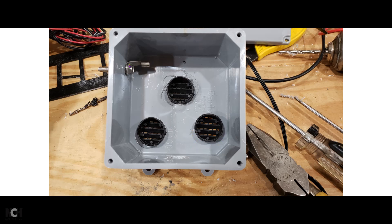Here is the antenna connection for the output of the transformer. This is a 10-24 hex bolt. I found hex bolts handy because you can put a wrench on them and really get them tight. I was not able to get a Phillips screwdriver in there, so this worked out great.